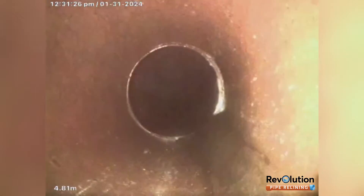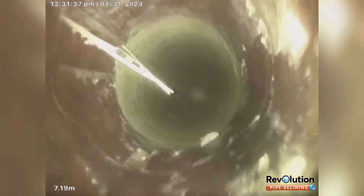So this is the line where we've cut the 85 out with the robotic cutter, where there was a massive disjoint and the horizontal section of pipework had dropped. We've had to cut the vertical section of the 85 out and make it a new section of 85. There's also a large hole in the pipe, so we've started the patch there.